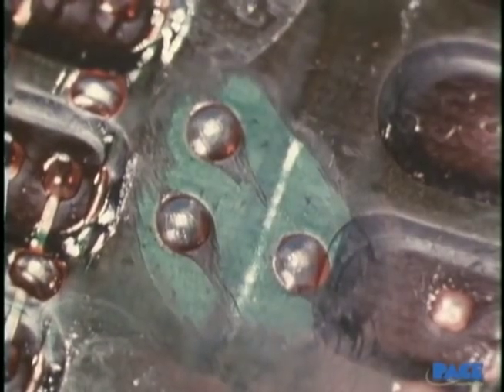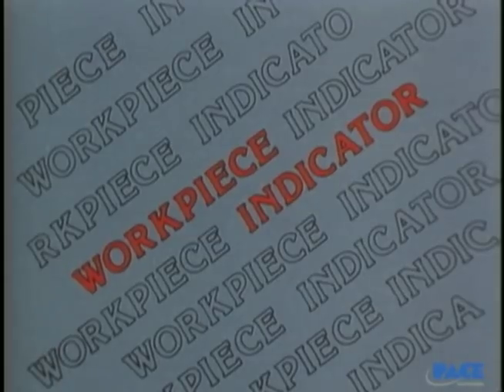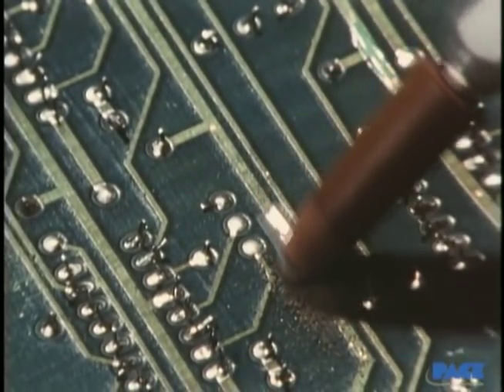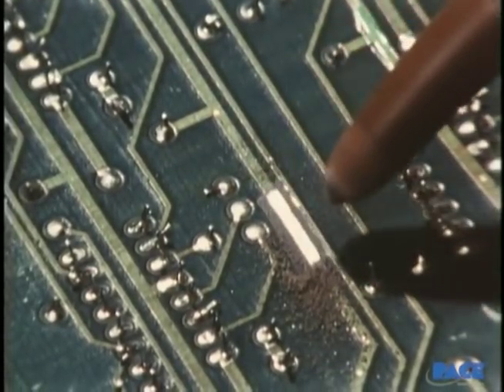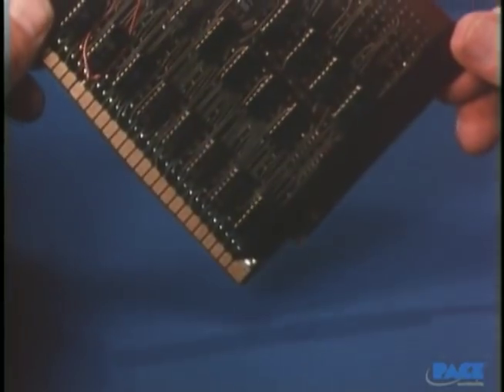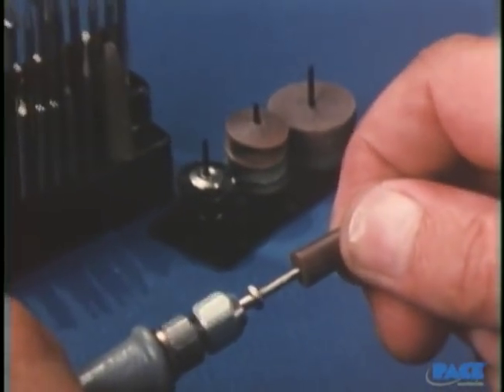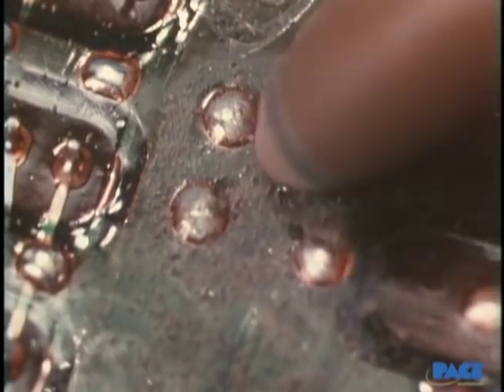Once we're down to a thin coating, we switch to abrasion techniques, and again we'll use the powered miniature machining system. Because of its high torque and constant low RPM, you can get controlled and precise removal of coatings without any mechanical damage or overheating. Our workpiece indicator in abrasion is a visual one — by watching the changing color on the surface of the work and the brightness of the circuitry, we can remove thin layers of coating with great sensitivity. High RPM systems, those running at 5,000 RPM or over, are not recommended; they can cause dangerous frictional heating and usually don't have sufficient torque to remove the softer, gummier coatings. Let's watch the abrasion method on a board with a thin, tough coating of polyurethane. The work begins with a fine, rubberized abrasive — ideal for hard coatings on flat surfaces. The tool is moved in a circular motion to minimize heat buildup and lower the risk of abrading through the circuitry.